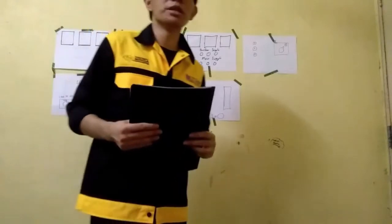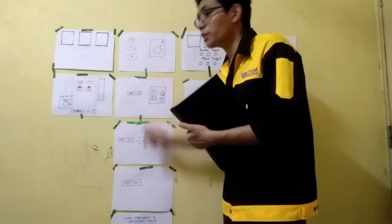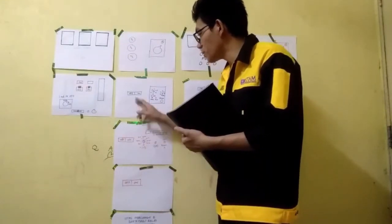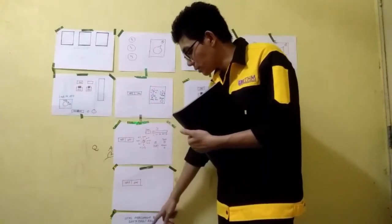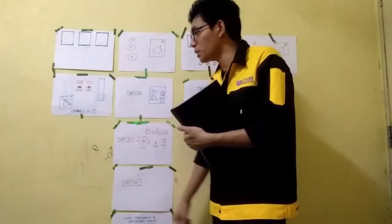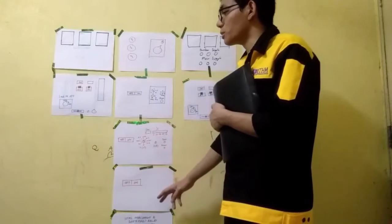For the bus bar coupling, the first step that we need to take is to turn off all the loads at the MSB1. So we turn off the loads, including the ERF and earth protection unit, and then you can see this is the power factor and capacitor. We turn off everything and we turn off the load at the MSB1.